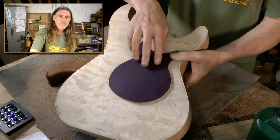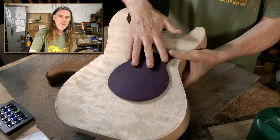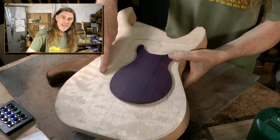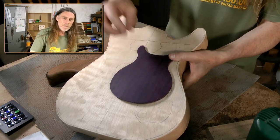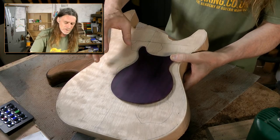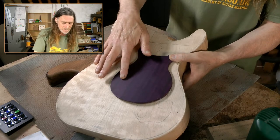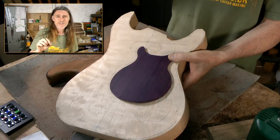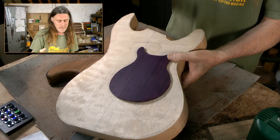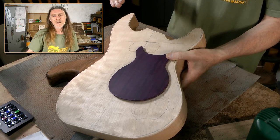But there comes a point where when you spray, you might get a run, or, you know, it's never perfect. Even if your wood looks perfectly flat, there's still grain. And when you put your finish on, it amplifies everything by 5. Imagine a drop of water, how a drop of water magnifies everything by 5 times. It's a similar effect. So any tiny little pores in the wood, or any tiny little defects, will be magnified hugely. So the basic finishing procedure is to spray thin coats and build it up,